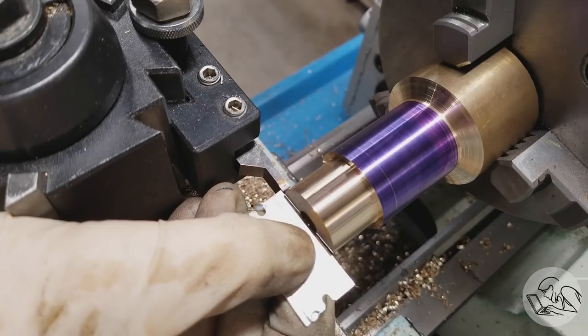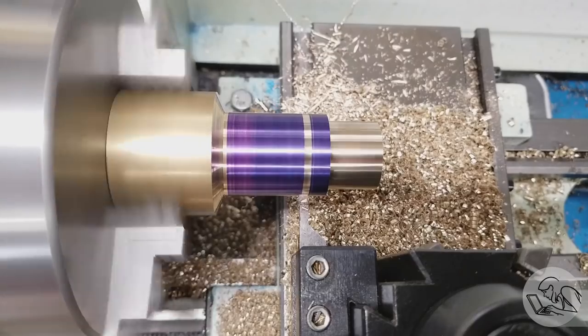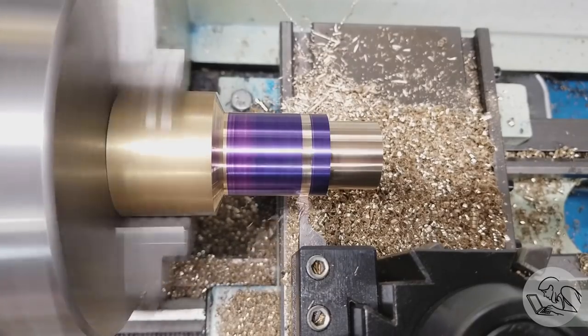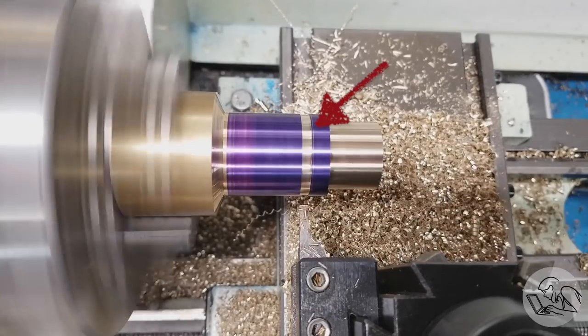So here's a trick I learned from Joe Pye. I'm using a razor blade and just sweeping the surface, and you can use that to feel when the end of the tool is exactly on the surface. And then I can use an indicator to count back the exact right amount so that I'm grooving directly behind the top surface of my part. And you'll notice that I'm behind my layout line. There's that 8th thou error that we talked about.